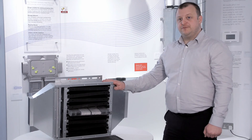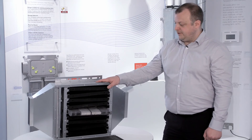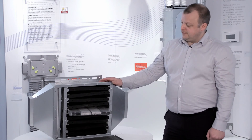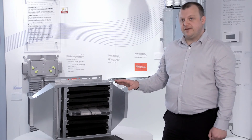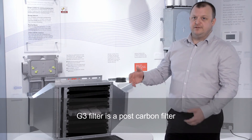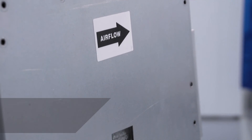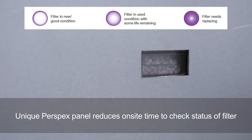In terms of maintenance for the NOx filter, if placed where recommended on the supply network of the heat recovery ductwork, this wouldn't need to be looked at for up to five years. For replacements, there is a replacement service pack available consisting of a G3 filter and however many carbon cells are needed — the quantity depends on the different sizes. To make things simpler, there is a viewing window so that you can see the colour cell changing once the filter has degraded over time.